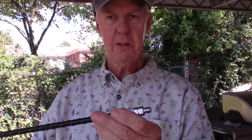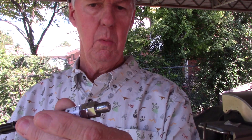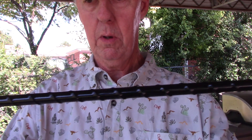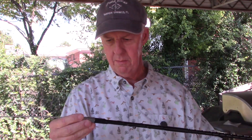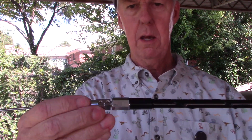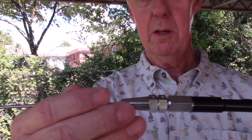What is a ham stick? Basically, it's a fiberglass rod with threads on one end of it. You can see the coil going all the way to there. Four foot of it is the fiberglass rod, and then your other half of the antenna element, which is just a whip, connects to there. And predominantly, they are used as a mobile antenna. But let's look at a couple of other methods to use them portable.